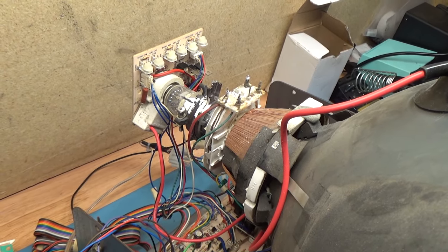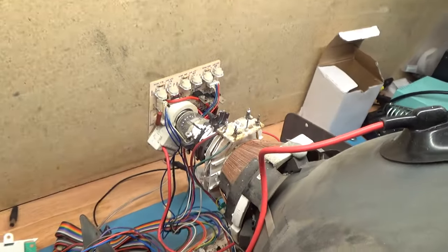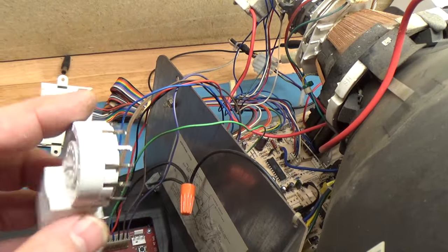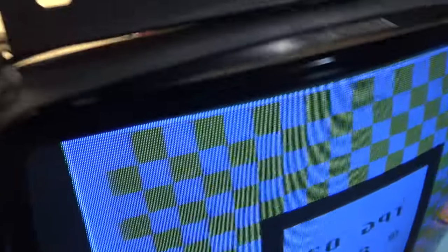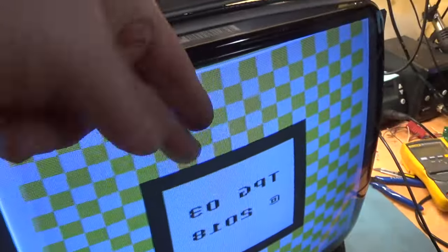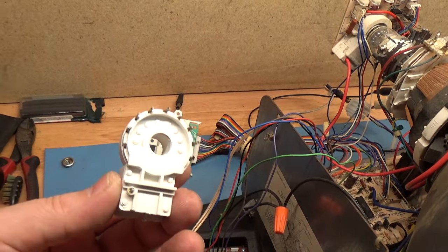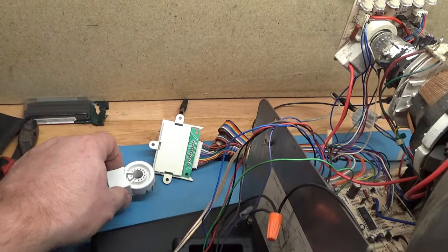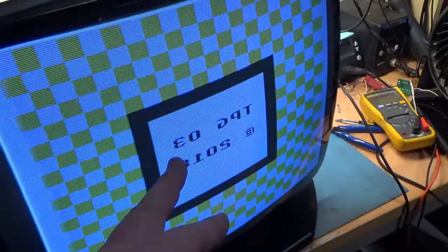The neck socket has been successfully replaced. I pulled a replacement from a spare parts neckboard I've got here. Here's the original one with the broken pin that pops out. After replacing this and putting the original new flyback back in, here's what we got — that solved the issue. It's backwards because I have the horizontal yoke connection flipped, but it's working now. The problem almost definitely was this bad neck socket, because like he said it wasn't having any issues until they changed the neck socket.